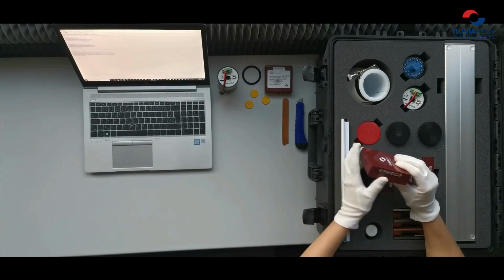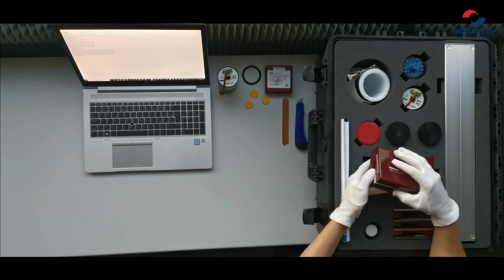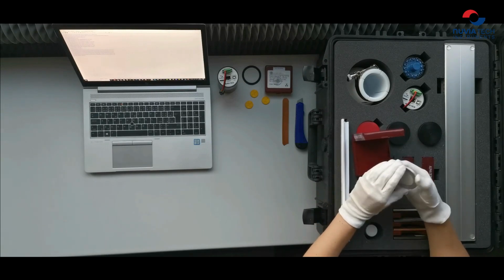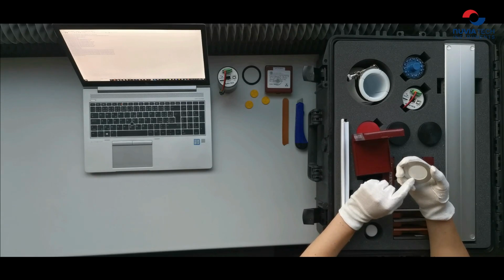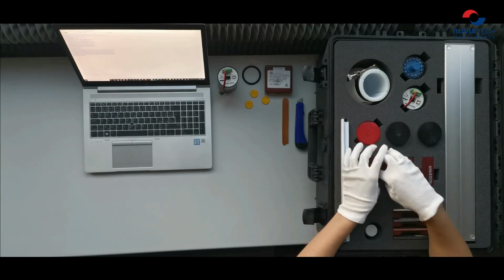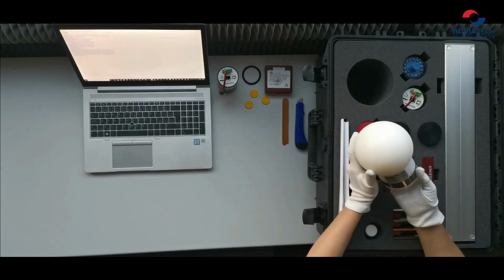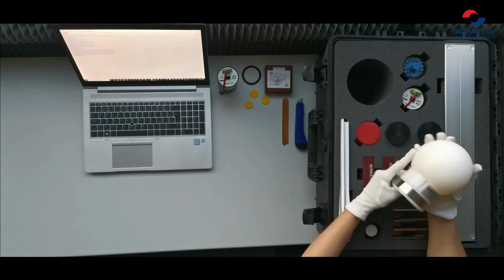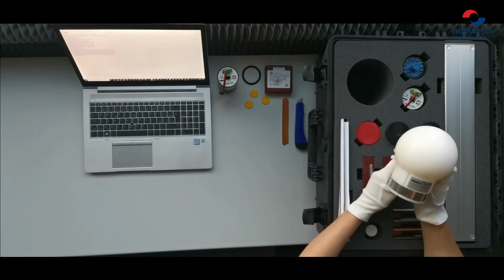The last detector here is neutron detector, which looks a little bit different compared to other detectors. This detector is based on a mixture of zinc sulfide activated by silver and lithium-6 fluoride. Lithium-6 nuclide is very sensitive to thermal neutrons. And that is also the reason why there is this polyethylene moderator. This moderator is here to show how important it is to moderate, or to slow down, the neutrons during the measurement to improve the detection efficiency in this measurement arrangement.